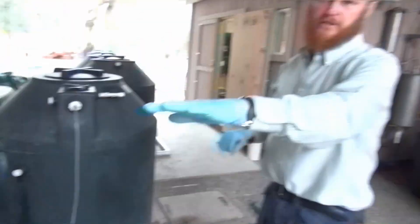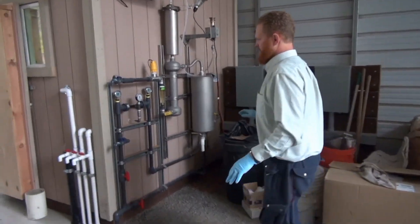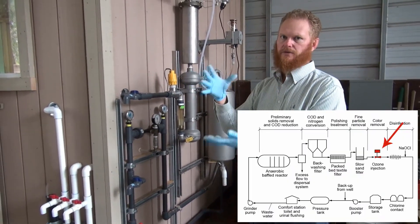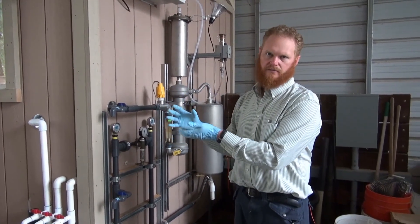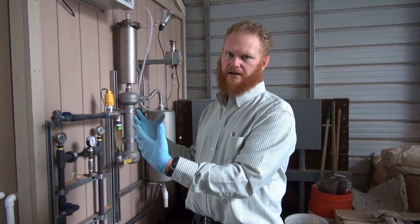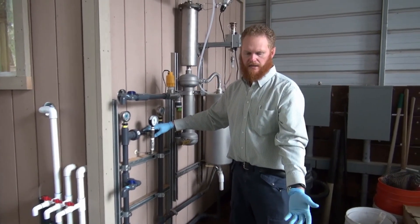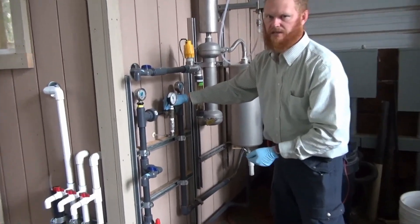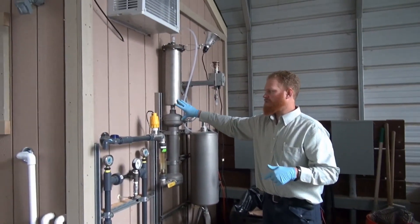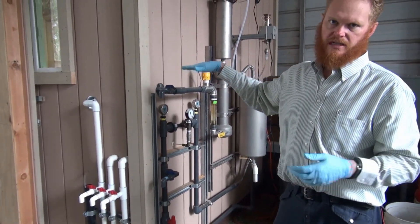After the particles are removed, the water gets pumped through the disinfection system, which consists of ozone, UV, and chlorination. The purpose of ozone is to take the color out of the water and make it crystal clear, making it easy to disinfect with UV and chlorine. Ozone is generated inside the building using a two-stage process: one stage pulls oxygen out of the air, the other converts oxygen into ozone. The ozone is injected through a Venturi injector, passes through a contact tank for the reaction, then through a system to destroy any excess ozone. The ozone-treated water then passes through a UV lamp.